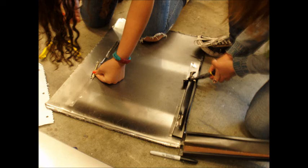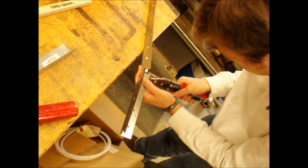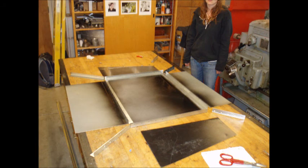To build the solar oven, first you will need to flatten the metal that will make up the oven walls. Next, the metal sides need to be cut to size. After you have the walls cut, it's time to cut the L brackets. These need to be cut to the same length as the corresponding oven size.